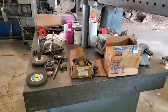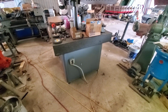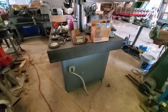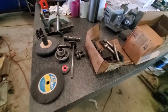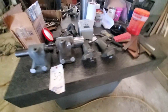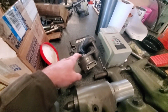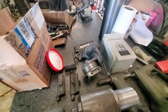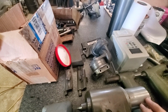My 48-inch inspection table is moved over into this area, a little bit more protected area in the shop. It's precision leveled in both directions. Currently, I've got a lot of parts sitting on it that came off of a new acquisition. That's a Cincinnati #2 grinder, so I have a couple of sets of centers for it. I have a Rockwell, I believe this is called a Univice, good for holding lathe tools and single point cutters and sharpening those at any angle that you want.